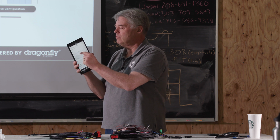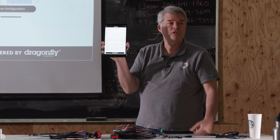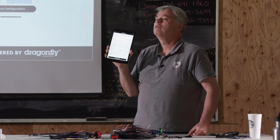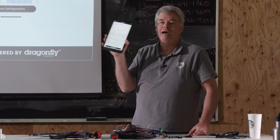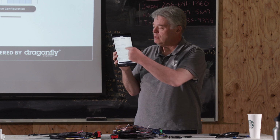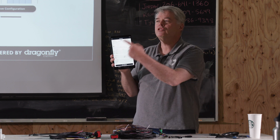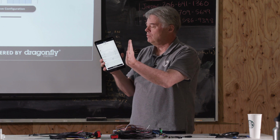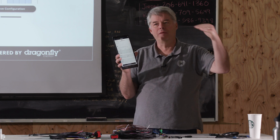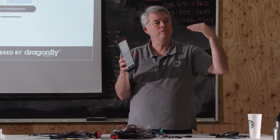Then the very next thing that we want to look at is down here in this gray, which shows how this battery is going to be charged. It's a summary of the charge profile that's built into the Wakespeed app, the database. That's what Victron has told us how we should charge that battery. There are ways to change it we'll talk about later, but this is what comes from the factory. That's it. So we've picked the alternator tab, we said the make and model, we changed the name, we picked the battery tab, we picked the make and model, and we said how many.